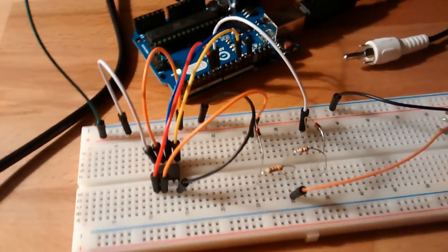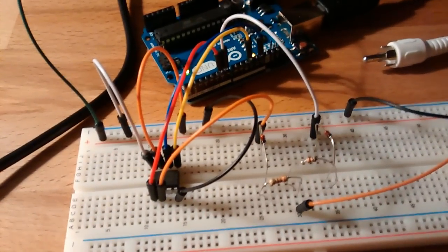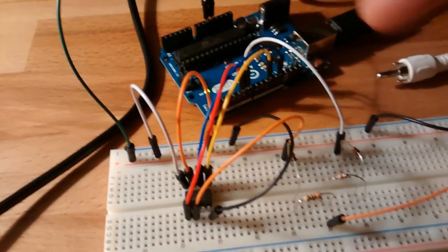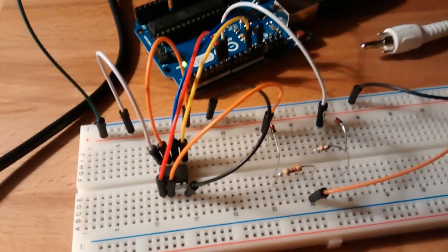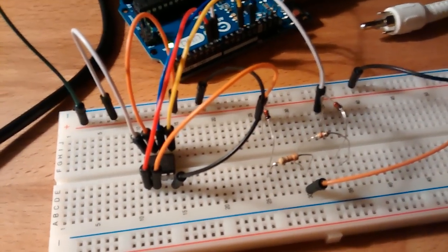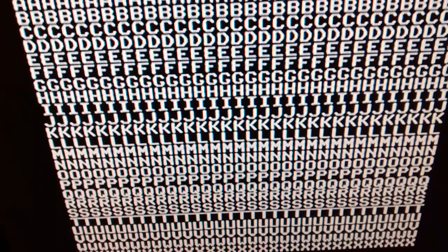There's nothing interesting really about writing. But when I'm reading back, instead of reading back into the Arduino, I'm using the SPI interface to send the data into the video output, so I can render video from external RAM, which is quite interesting.